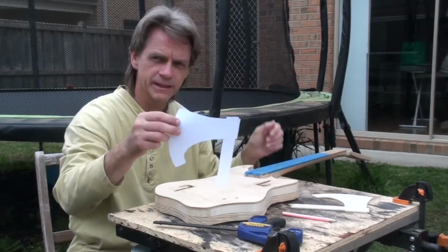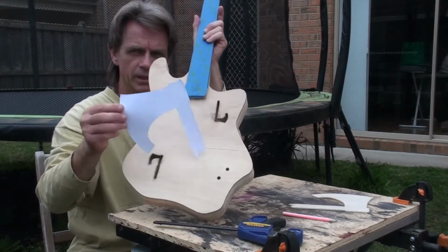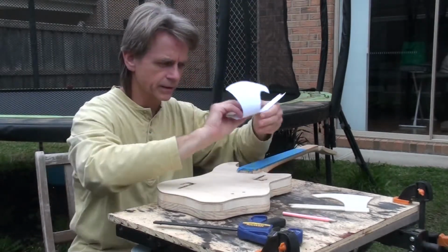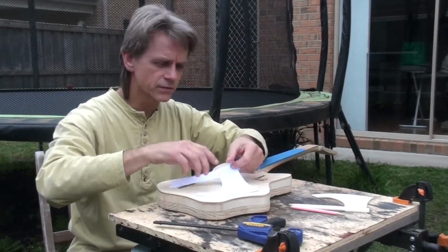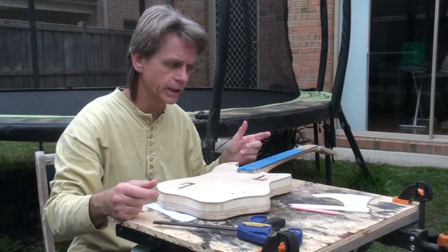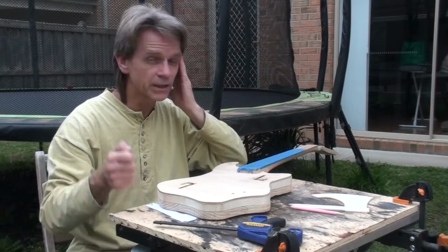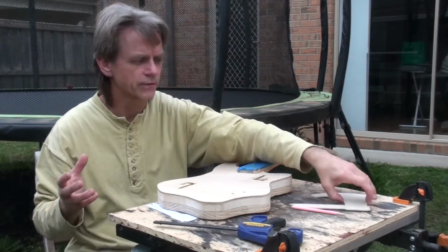So I cut this out, piece of paper. It's a Skeggs with like a broken handle or something on it. And then what I did, I laid that down over a piece of 3mm timber, drew around the edge of it, so that was my template for drawing it, and then I took it to the bandsaw and just started cutting a bit of the timber off, and then I was going to do the rest of it with a jeweler's saw, but it ended up being pretty easy to do on the bandsaw, so I've come up with this.